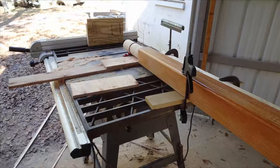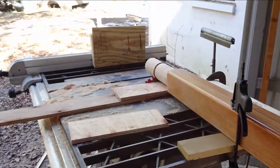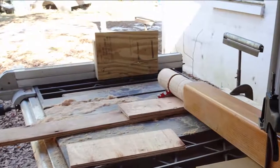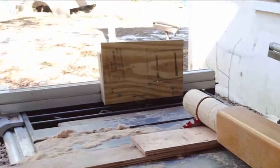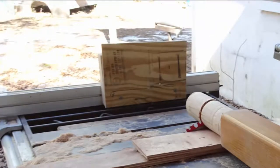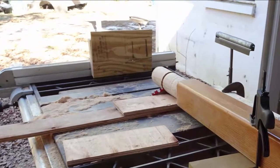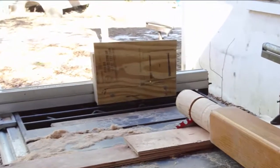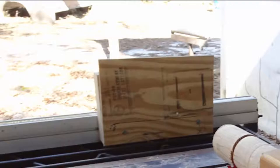As you can see in this picture, we mounted a vertical plywood section to the fence of the table saw and set the height by drilling a 1/4 inch hole. And then we went to the other end of the bowsprit and set the height from the floor the same as the height of the hole in the fence attachment. This made the bowsprit level with the floor, and now we could commence using the dado bit to make circles.